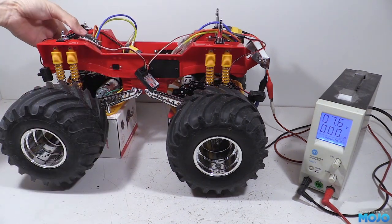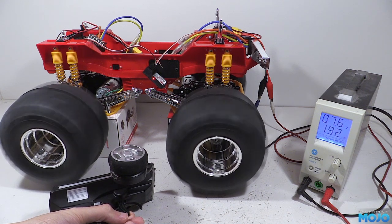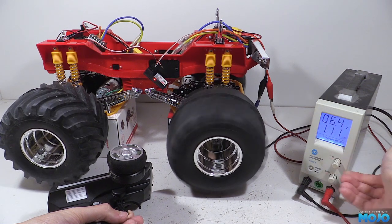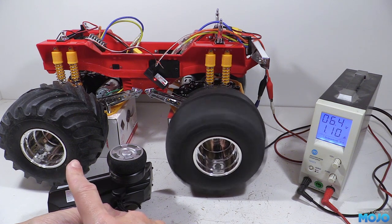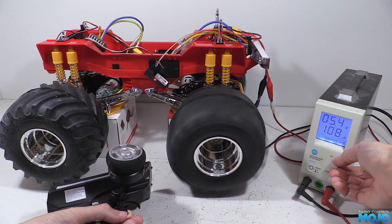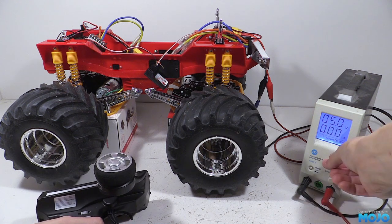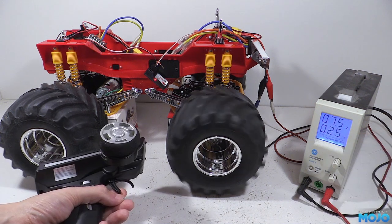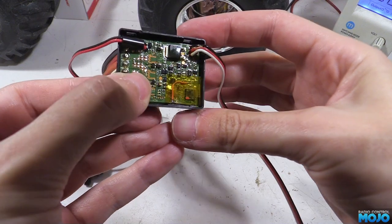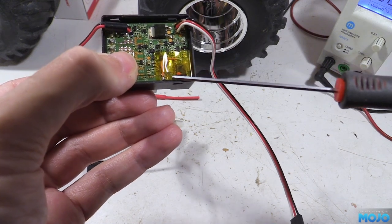Now it's all connected up, we can test the cutoffs. With everything switched on and working I'm going to apply a little bit of throttle to get both ESCs running, then very slowly turn the voltage down, simulating a battery going flat. At around 6.5–6.4V our modified ESC cuts out — a nice, extra safe voltage for LiPos. As we keep going, eventually the other ESC cuts out at just a touch over 5V — definitely not good for LiPos. If we pick the voltage back up, both ESCs start up again and we're back to all-wheel drive. We just need to mod the other ESC. After a bit of conformal coating scraping, an 0805 resistor, a bit of wire and some Kapton tape for safety, we have both ESCs modded. We can clip the cases back together and they're ready to fit.